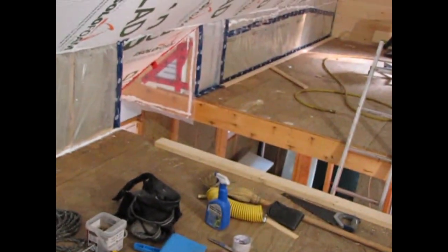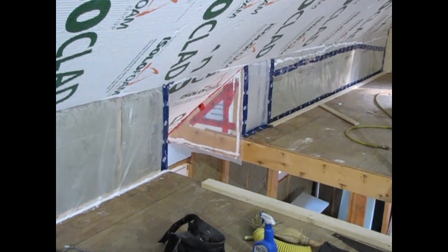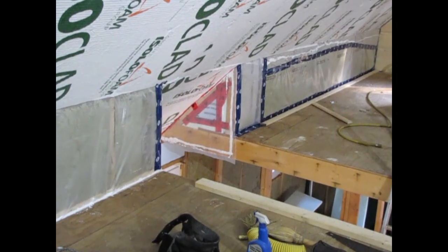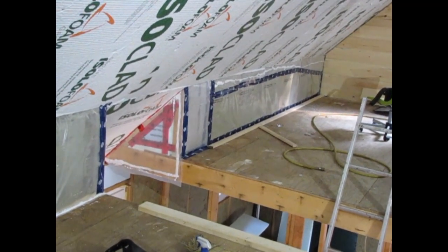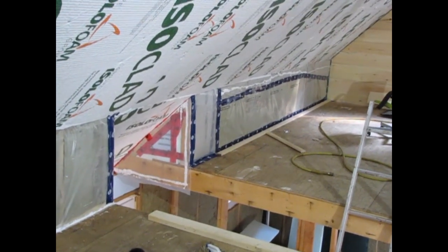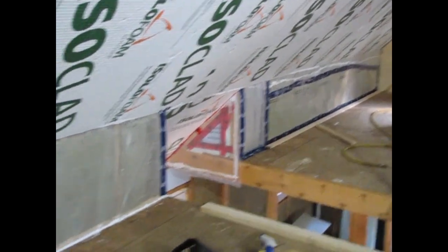There are some indentations in the back of these boards and some V-bevels that should keep it really tight around the window. The area around the window frame is foamed in place with urethane foam, which should keep it tight. I may try to wrap the plastic around the inside for the door jamb. A friend was up helping — he did the sealing and taped it all up, and I told him you also have to caulk around there for a continuous vapor barrier. The caulking there is supposed to join with the caulking under the 2x4.